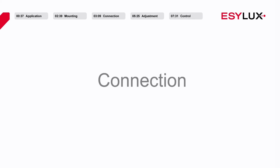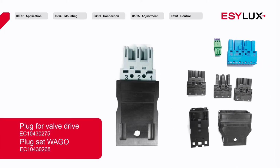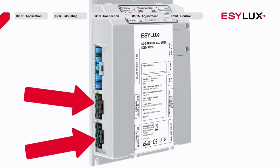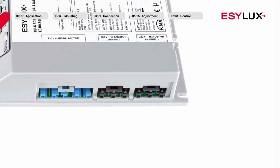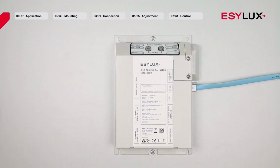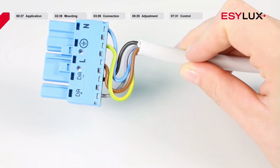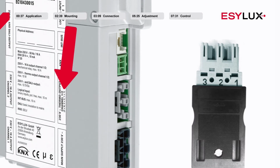The room controller box features WAGO interfaces. You can purchase suitable WAGO connectors from our product range. On the left-hand side of the room controller box, you'll find two 230-volt switching outputs. Use the black 3-pin connector to connect devices to these outputs. When connecting the cable, take note of the terminal designations on the connectors and on the room controller box.